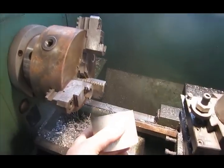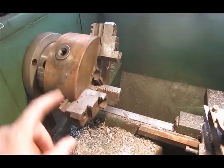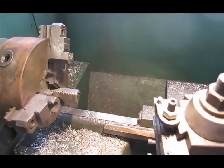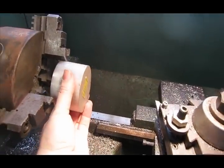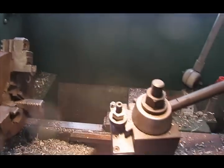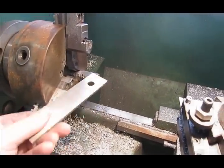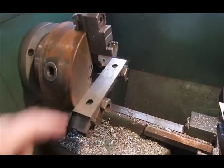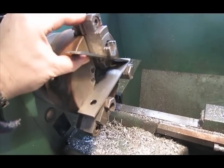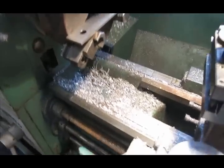This is the block of aluminum we're going to make the pulley out of, and we're going to put it in the three-jaw chuck. Just like a drill chuck, when I tighten up from the lugs, all three jaws move together so the piece is always held on the center line. However, for what I need to machine, I need to hold this pretty close to the edge, which is going to cause a high probability of getting it in crooked. So there's a little trick I use — I use a set of machinist's parallels and set them against the chuck. One parallel rests on two of the jaws, and the third I can hold up in place while I put my piece of stock in and tighten it down.